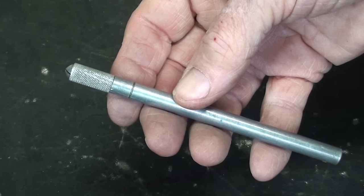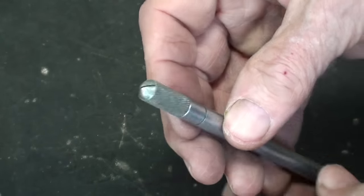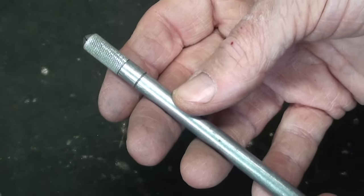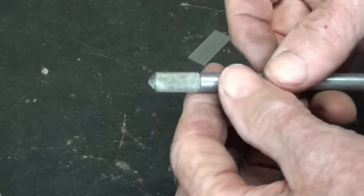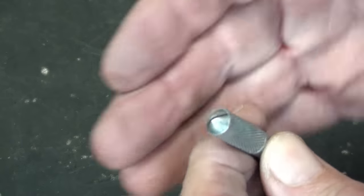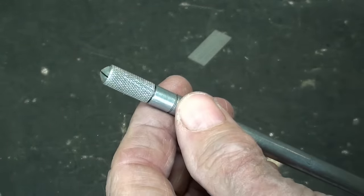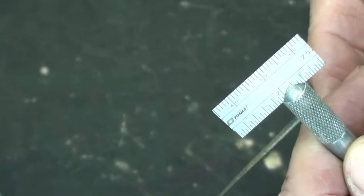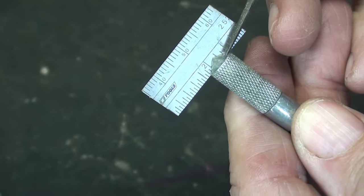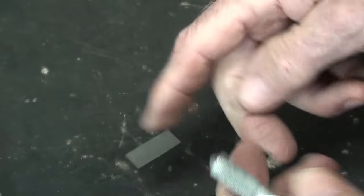Here's another X-Acto knife — I think they only cost 12 cents. This is used for holding X-Acto blades. The problem is there's almost no collet sticking out, so no matter how tight you get it, it's probably easy to pull it out. No good. But let's try a variation of this — and that's where I spent three hours. This is the original collet that came with it. I thought no problemo, I can make that in maybe 15 minutes. But the slit is the real problem, plus there's a taper here. I wanted to make another one that is longer so it would grip the rule better.